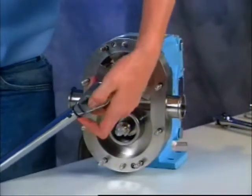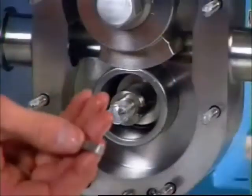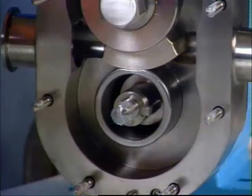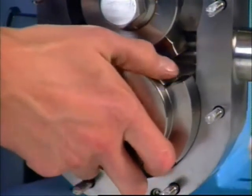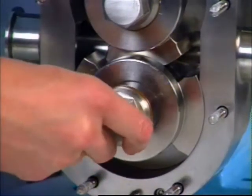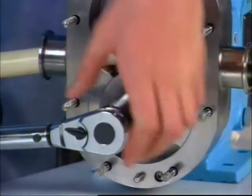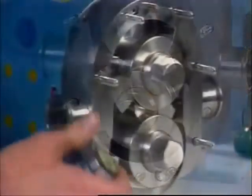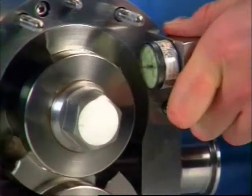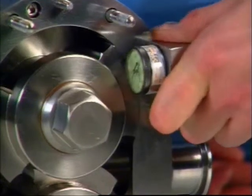Using a rotor nut on this shaft and using the wrench, rotate the shaft until the rotor wings are in a vertical position. Install the second rotor and key, then install the other rotor nut assembly onto the shaft. Block the rotor with a dowel and torque it to spec. The rotor wings must be below the body face and can be felt with the fingers or thumb. You can also use a dial indicator or a straight edge and shims to compare front face clearances with table values.